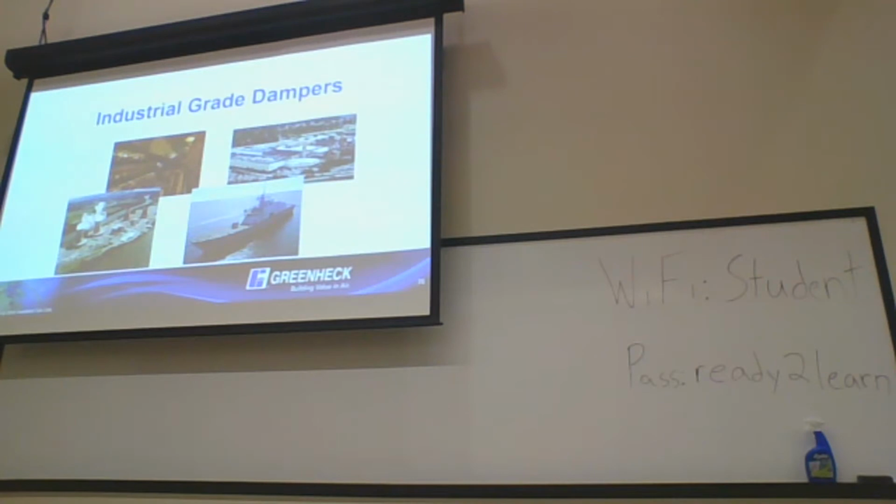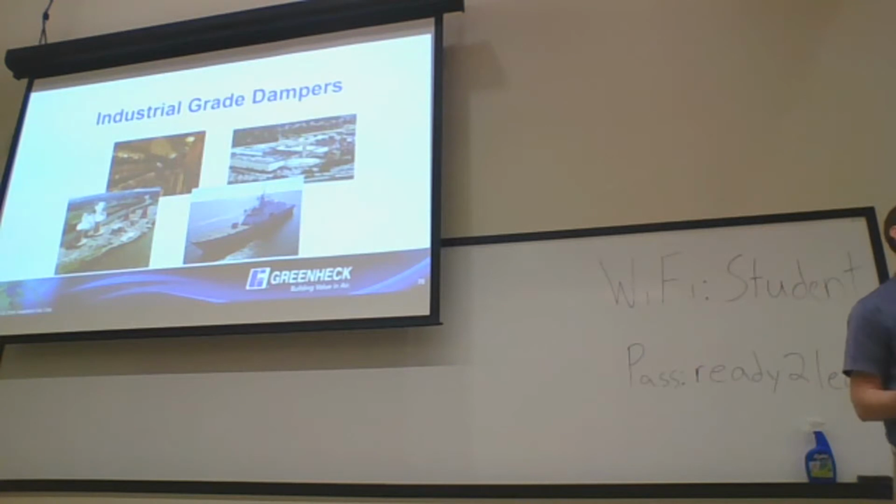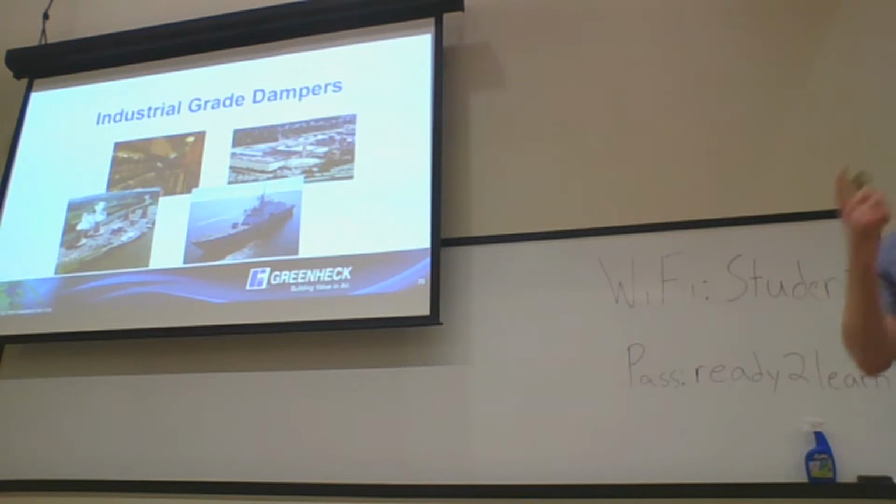Not well. I mean, yeah, if it gets too big, that's where they're going to say you need one on both sides. I think we can go to like 144 by, what is it, 96? Oh, that's pretty big. So you can still go pretty darn big. But like I said, if it's a 3-hour rated damper, it has to be 2-sided at that point. If it exceeds a certain height or width, there are multiple factors. But for the most part, 90% of the dampers that are installed can use a single-sided retaining angle. 90% of the dampers we sell should say that you can use that single-sided retaining.